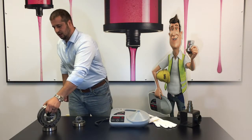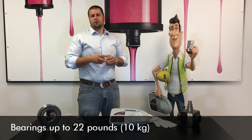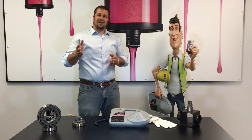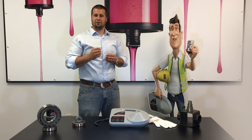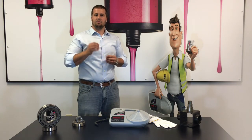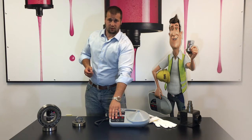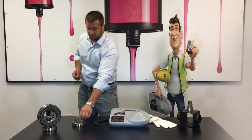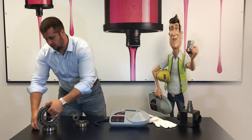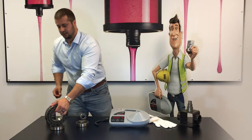Those are inner diameters, and it can heat bearings up to about 22 pounds. With two heating modes — both temperature and timed — the Volcano's versatility ensures proper and efficient bearing heating in a multitude of applications. Tunable power levels allow the user to heat the bearing without damaging or warping any shields and/or seals during the heating process.